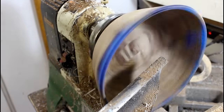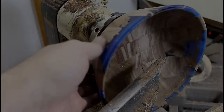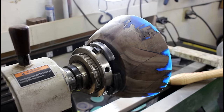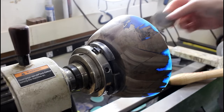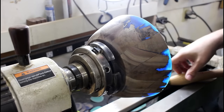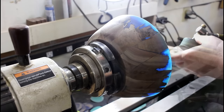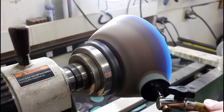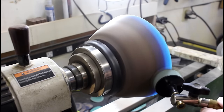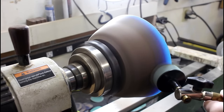Any other imperfections we can fix with our 80-grit gouge, a.k.a. sandpaper. I'm just going through the grits here — started at 120, working my way up progressively finer and finer, currently at 400. The lion's share of the work is done at 120; the rest of the grits are just to get rid of the previous scratches.